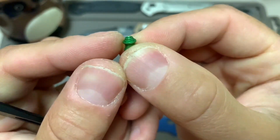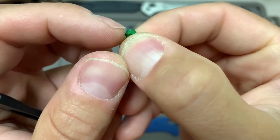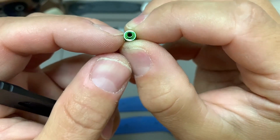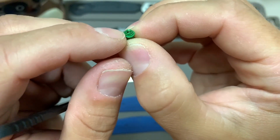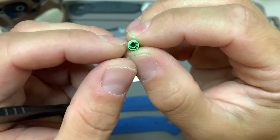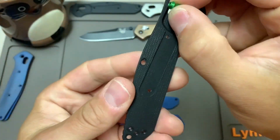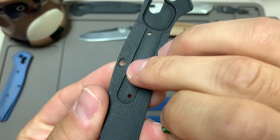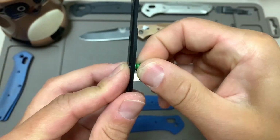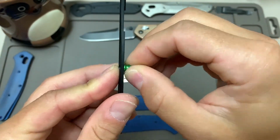So you'll notice with the factory standoffs, there are two levels there. The words are escaping me right now, but you'll notice that it's tiered in two places, and one of them has flat spots. It's not perfectly round. And so that engages right here. You'll notice that slot is not perfectly round and has flat spots. So it actually engages that, and the standoffs cannot fully rotate. They're locked in place like that.